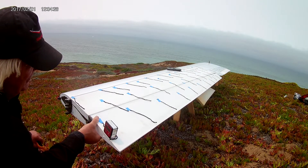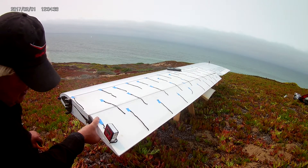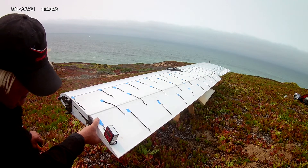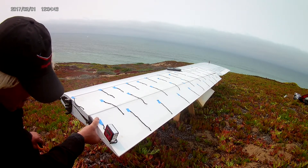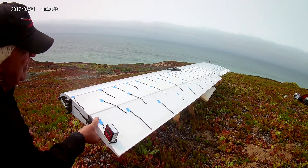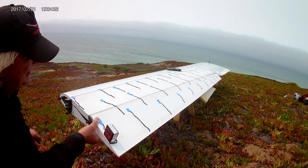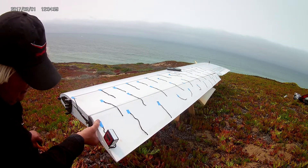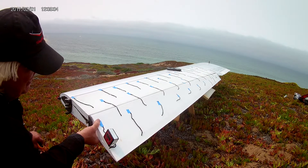You can see the tufts moving around — they're pretty well behaved here at 13 degrees. Taking it up to 16, just about 16 — there's 20, 21 — bring it back a little bit, there's 20 right there. At 20 degrees it's starting to have problems inboard, but outboard still looks reasonably well behaved. By the time I take it to 25, it's all gone.